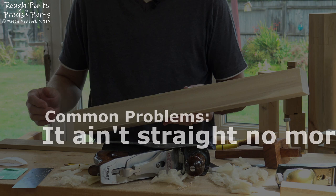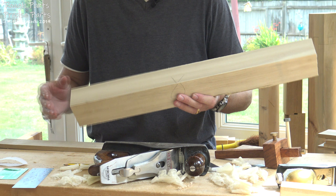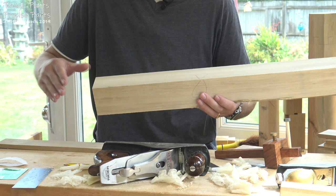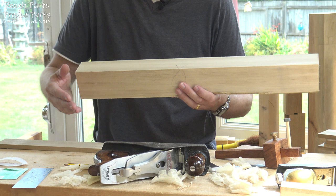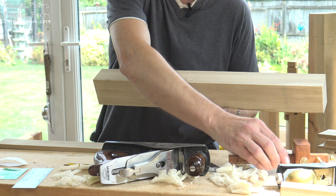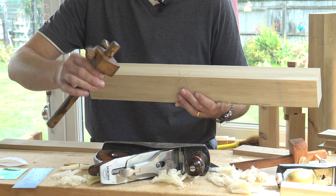When I was breaking down the rough plank, one of the things I did was produce two faces that were at 90 degrees to each other, and then I sawed the boards off through there. Every time I took a board off I re-flattened that side and made sure it was at 90 degrees to the other face. I was marking them with a pencil gauge — giving myself a rough line to saw to. Today we're moving from a pencil gauge to a marking gauge with a little crescent knife in it, which gives us a much more accurate part to plane to.